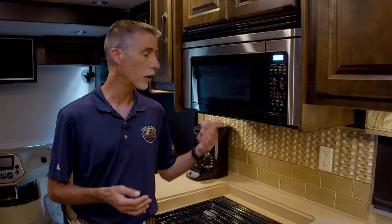For example, 30 amps of power. If your air conditioner is running, it's using about half of that. And if you've got televisions and maybe a coffee maker or something else going and you fire up a high draw item like a microwave — bang, you popped your breaker.